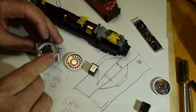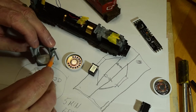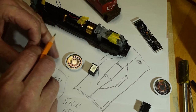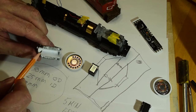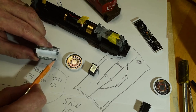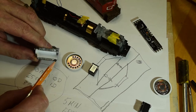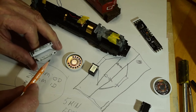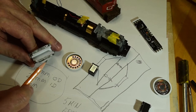And then I just shoved the piece in there that's proud on the bottom and sides. Like, don't cut it exact size. Just slide a proud piece in, bend it in, and then hold it for 5 minutes till it sets up. And then where these little strips were, as you know from part one, those were CA to the metal. I put a little bead of CA on the corners there just to anchor that bottom extra strength. And then I cut away towards the frame with a really sharp number 11 blade.